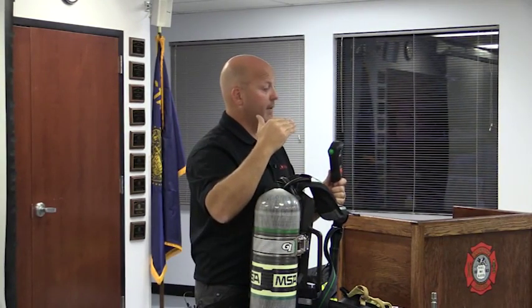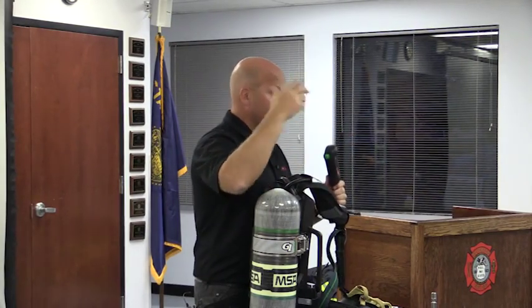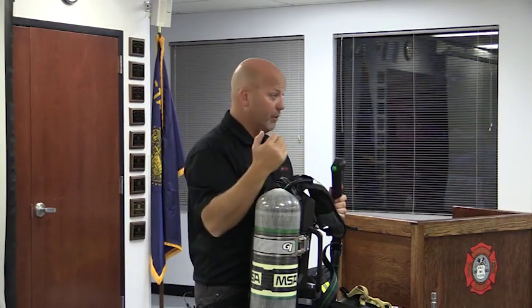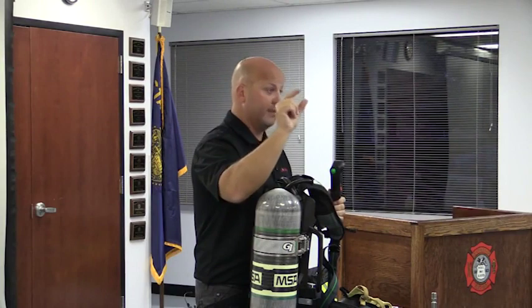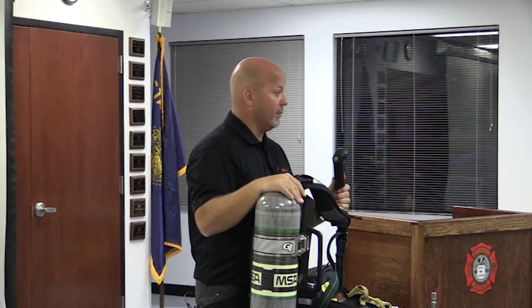Make sense? Active breathing, last 60 seconds. Assigned ventilation, huffing and puffing, says I got 10 minutes of air. I sit on a ground monitor, I'm not breathing as heavy, I push twice, it now says I have 30 minutes of air. Because I've changed the rate of consumption over the last 60 seconds versus what I have left, and that math equation has changed for me.